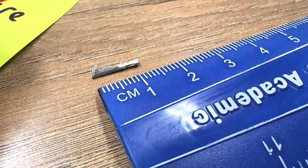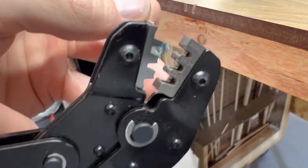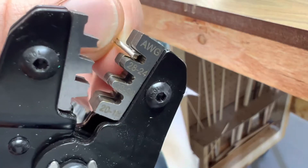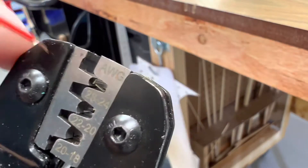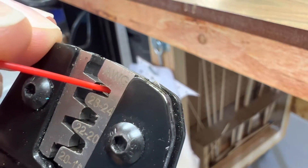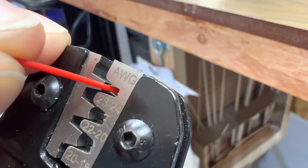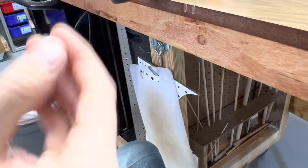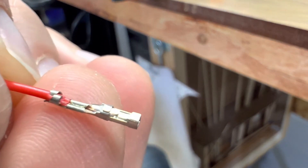If you absolutely must, take three or four millimeters off your insulation. Grab your crimpers, find that shelf at the top, and hang the wings on the shelf. Pull it towards you until it hangs up, then go click click until it holds. With cheap wire — sometimes advertised as 28 gauge but closer to 30 — feed it in so the insulation comes out to the wings, then go for it. You're going to get two crimps: the long wings grab onto the insulation and the short wings grab onto the copper.